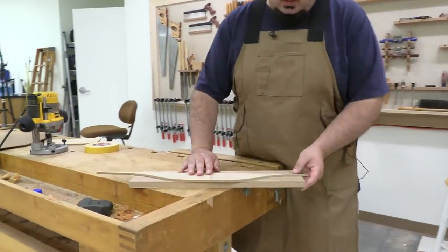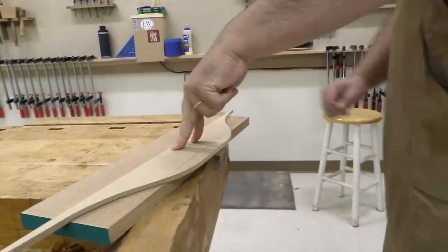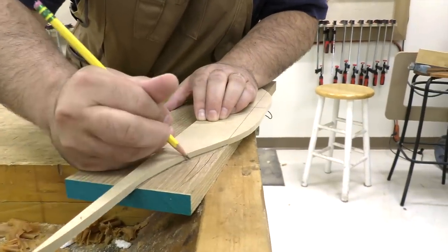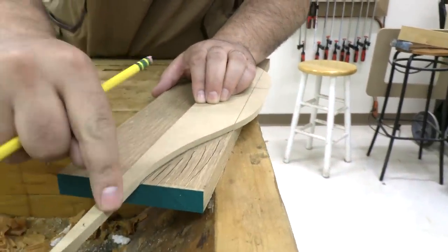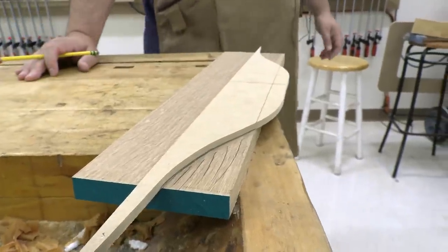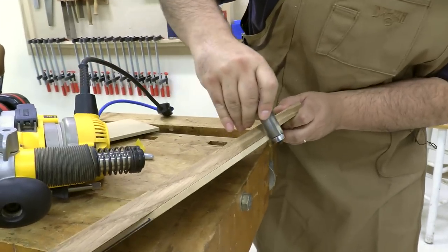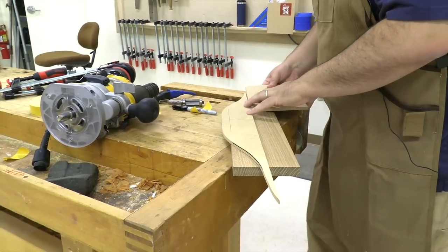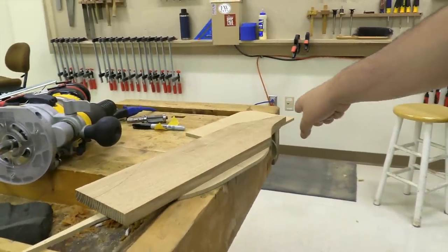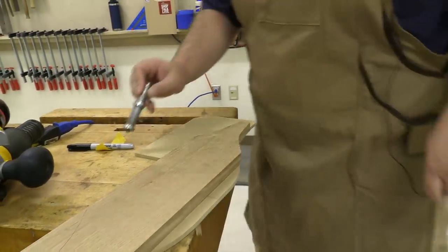Let's actually route this curve onto this piece. Since we want to route in this direction, I'd cut the majority of this out on the bandsaw and route right there. But on this side — I'll darken it so you can see it a little better — if I go from here to there, I'm hitting that grain, I'm going uphill, and it's going to tear out. No ifs, ands, or buts. So what are we going to do? We could flip it over and use a bearing-guided bit with the bearing on the other side and go that way. I'm going to flip this piece over, and now I can run downhill with the grain going in the correct direction, referencing off this bearing. Let me load that up in the router and we'll get to work.